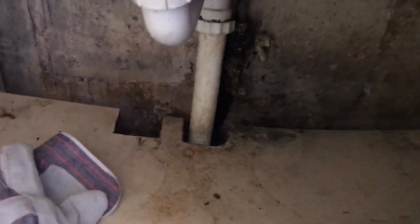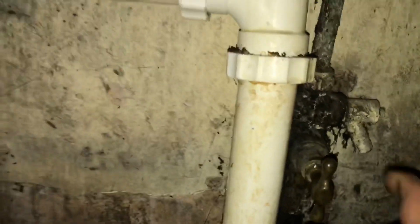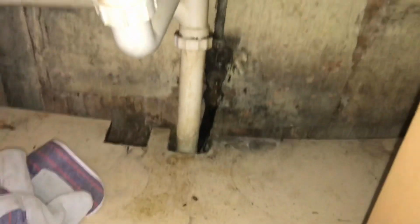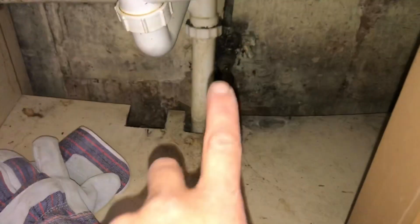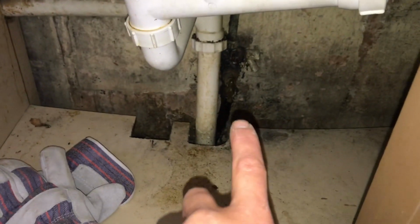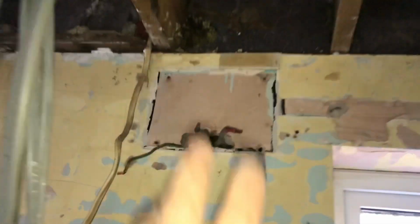Okay, so it's coming back to me now. The water is located here, and as you can see, it's a black old plastic farmer's pipe type thing that they used to use around these areas. That's the stopcock, so I'm happy that that does not need a water bond, because there's no copper pipes associated with the water that dive back into this concrete floor. So I'm happy that that doesn't need a water bond, and I would also label the board up as incoming water main plastic.